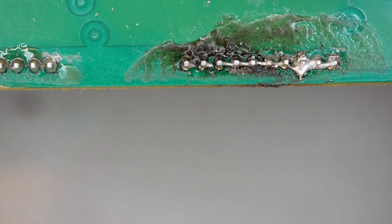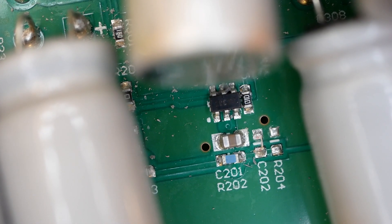Let's flip this thing over and take a look at the other side. Not a whole lot to see on here, but there's a few interesting things. I flattened out all the MOSFETs so we can look around a little bit. You can kind of see it, sort of half occluded by that electrolytic capacitor right there — but there is one of your gate drivers. I don't know if that's a low side or a high side, and I haven't looked up the part on there, but that's one of your gate drivers for one of the phases.